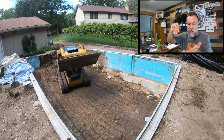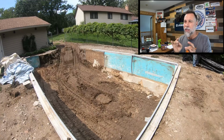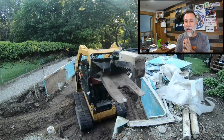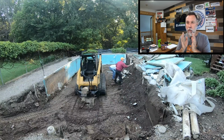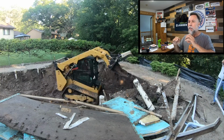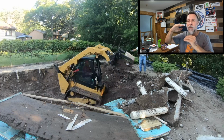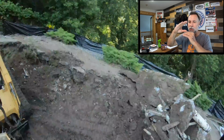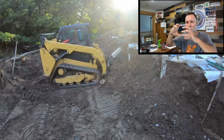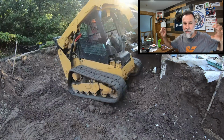Having a little bit of deflection in that soil, as long as it's a non-organic material, can sometimes, with caution and understanding, be an okay thing. But you can mess that soil up if you over-compact. What happens is you'll get water down below, and if you're using a vibratory compactor and pounding the soil above it, that water will actually wick up into your soil and disintegrate your results. But if you use the right amount of compaction and just gently squish that soil over the questionable areas, you can actually use the soil above it to create a bridging effect.